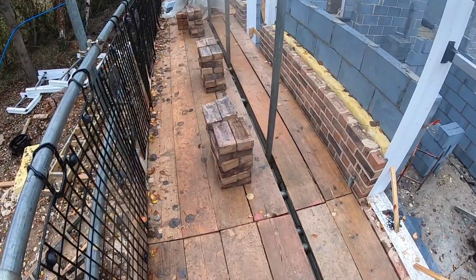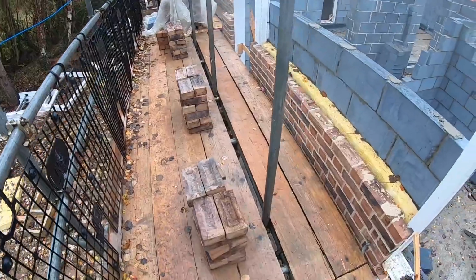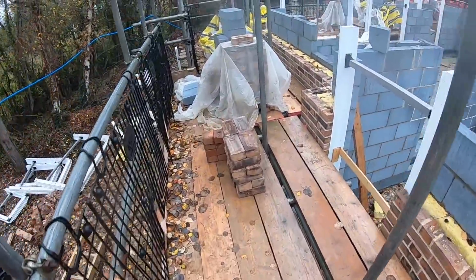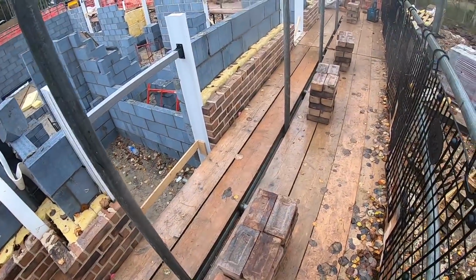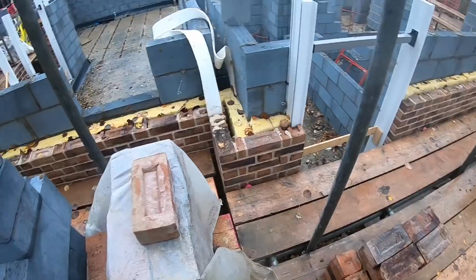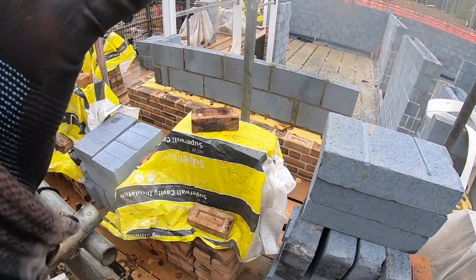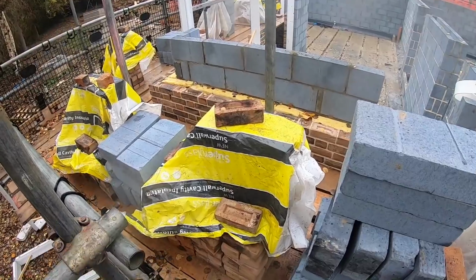Probably sounds ridiculous to a non-bricklayer or non-hod carrier, but how you load out really can massively affect how much you earn. If it's not done right, if things are made awkward, especially with Flemish bond, it's very awkward, a pain in the arse. But it's little things like when Tom went round and loaded out the first one, because he was used to loading out for just stretcher bond, he loaded out stretchers, blocks, and then realised after that he had no room for the halves.